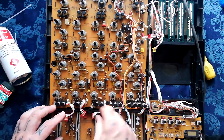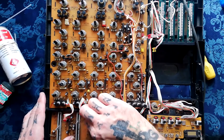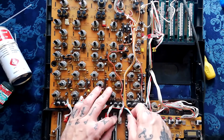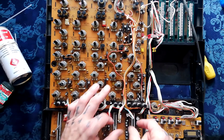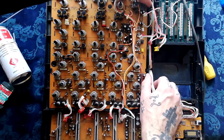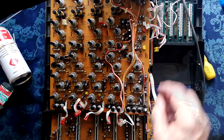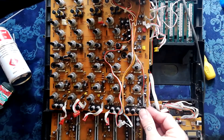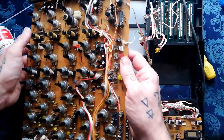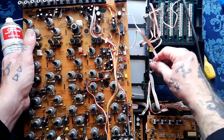This says 'bar graph' and the headers match the color of the connectors. Moving down here, all our faders are on a separate board. The cleaning process for the faders is going to be more or less the same - four like that and then an additional two white ones with different numbers of pins so you can match those up easily. Two clips where my two thumbs are - clip those in.